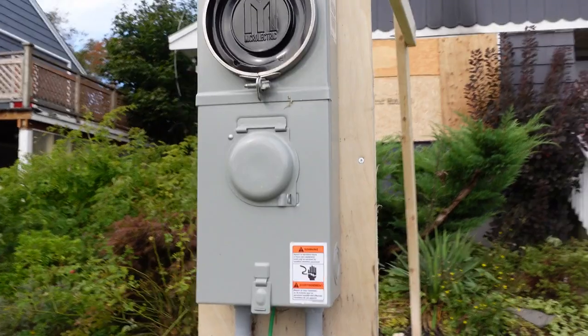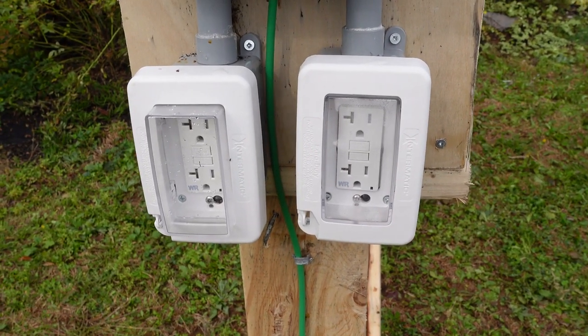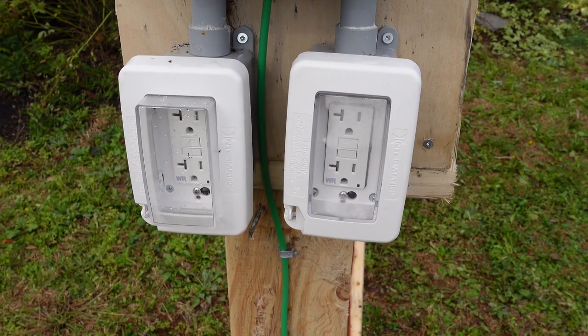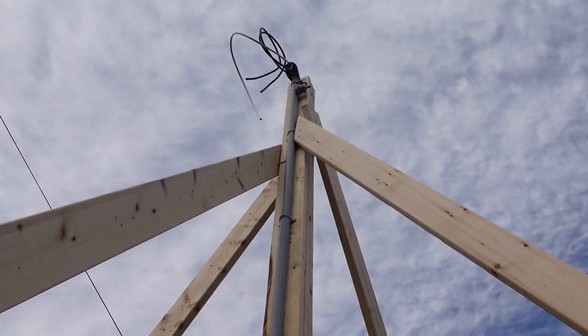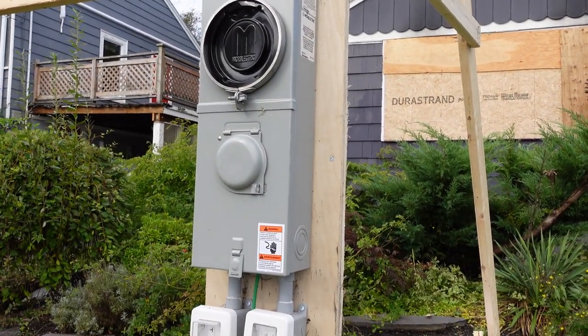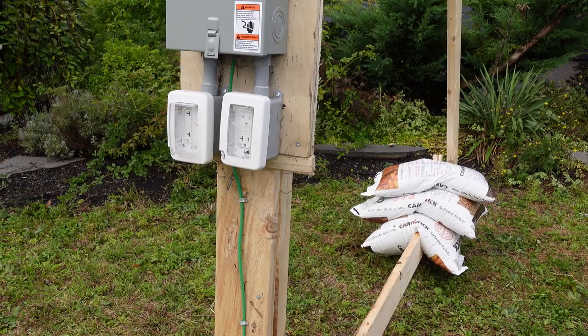Here's where our combination meter base goes — this is a double-pole 30-amp breaker feeding two single T-slot 20-amp GFCI receptacles for construction purposes so it can have power. The main lines are rated at number one aluminum, which is good for 100 amps, but through the internal connections of the meter we reduce it down to a 30-amp breaker — so this is technically only a 30-amp temp service for construction purposes. That is how we erect a temp service up here in the true north of Canada. This storm ripped the service right off the house and the house caught on fire, so we put this temp up for restoration through the insurance company. Hope you like the video — don't forget to like, subscribe, and we'll see you on our next video. Bye for now.